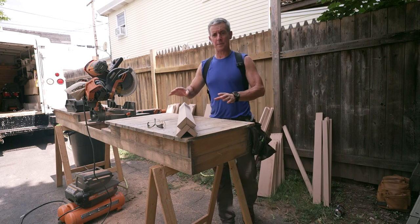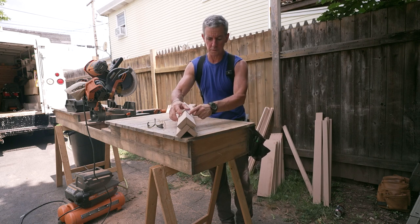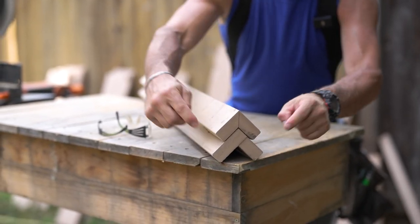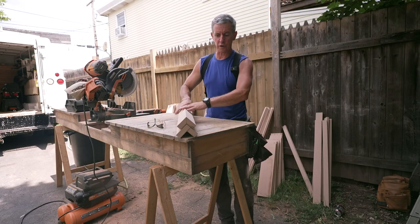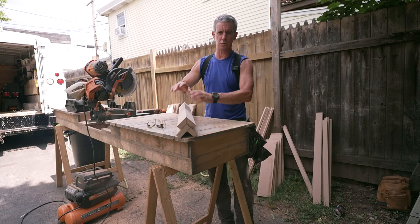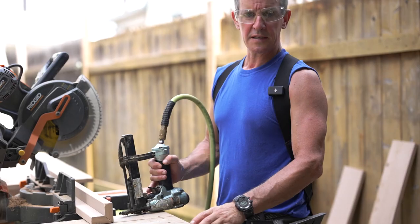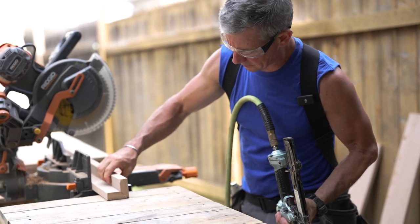The next bunch of steps we're gonna show you lead us here. This is our mitered corner post, and this is a nailing flange, even though we'll use screws, a nailing flange to put our field pieces on. So we'll show you the miters, we'll show you the connections, we'll show you the assembly details, and that's what we're doing right now. Step one of corner post assembly is putting the mitered pieces together.